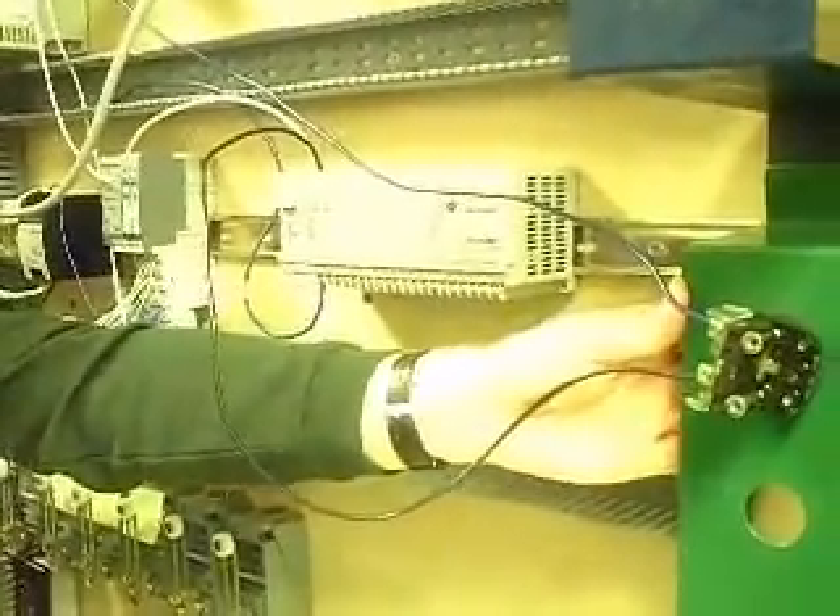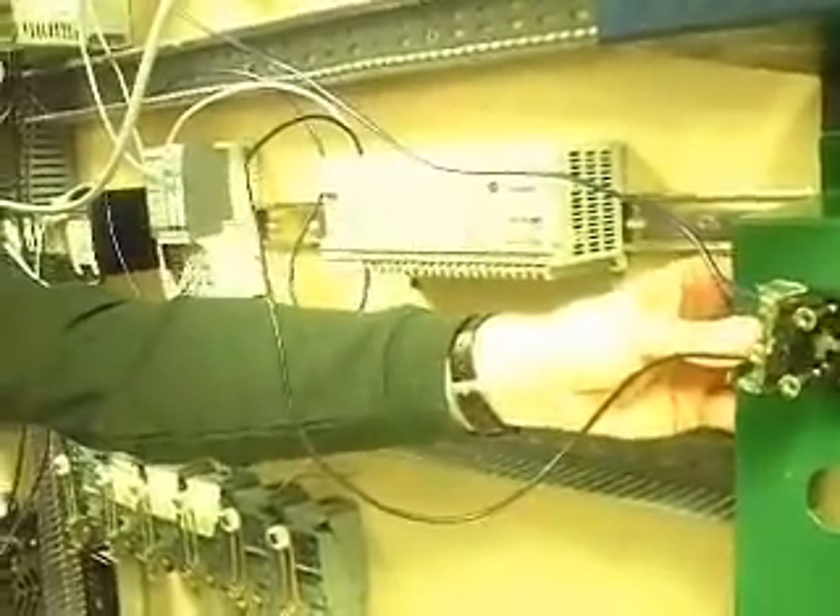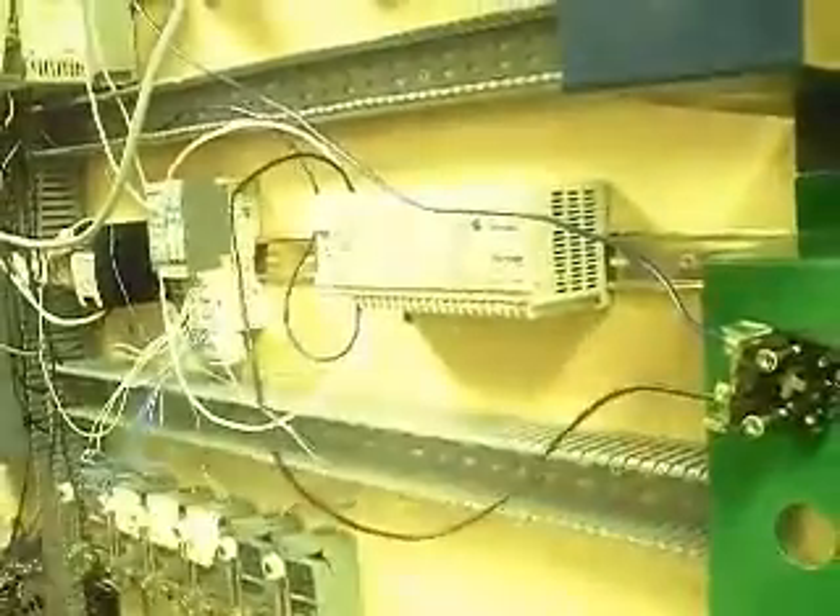So I'll go back — you see it goes through this little self-check, and this output is on down here. That's just because the program must be set up that way — that has nothing to do with what I just did. So now when I push this button — how dramatic, huh? Input zero comes on because that's the one I'm hooked to. If I moved it over to input one, input one would indicate that it's got something coming on. These are modular inputs. They'll be indicators telling you whether or not it's active, which can be useful for troubleshooting.